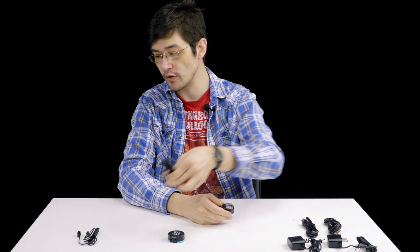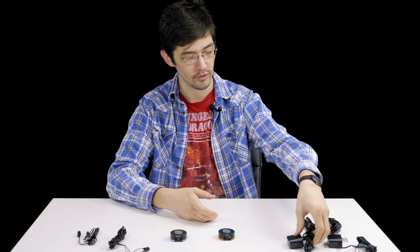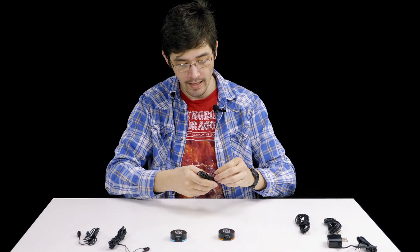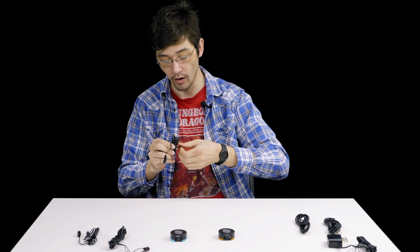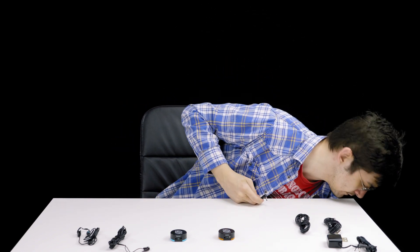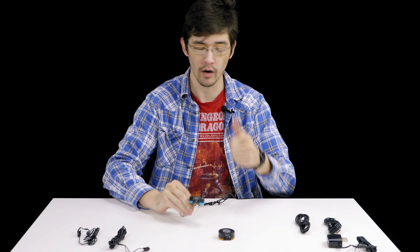You'll also need to make sure that the unit is powered up — we include two power supply options: the standard wall wart power supply that just plugs into a wall outlet, and a USB power supply that'll plug into a USB port on your TV or wherever you have available USB power. A good thing to pay attention to is the first time you plug it in, this little indicator LED — which will normally be off and will only blink when it's receiving signal — should flash briefly, and that's a great way to know if you're actually getting power. So when we plug in the power supply, you should see that light come on briefly, and it does, so we know that we are getting power.